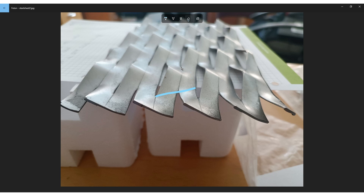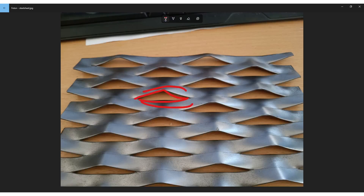We have a repetitive pattern - you can see these edges over and over again, this is the same bend repeating. My thinking here is I wanted to change so this bend down here is the same as this one. That means I really don't need to do one full part - I only need to do this section, because this here will be a rotated image of that. And then the two on the back are mirror images of this here, so I really only need to make this one.